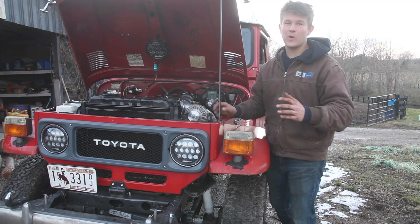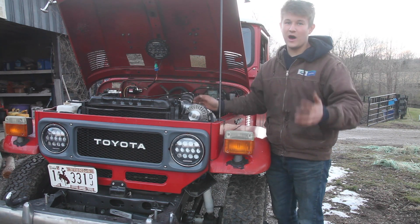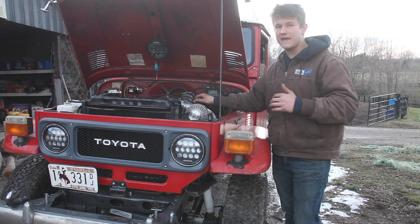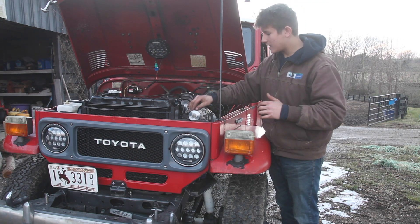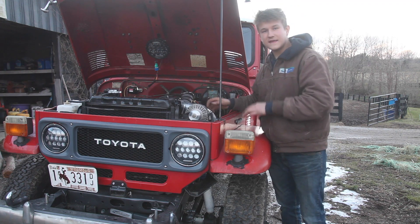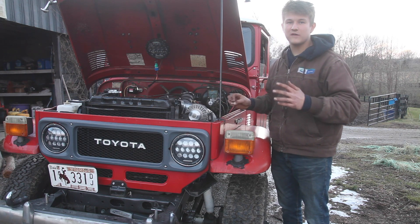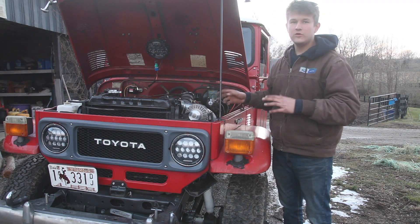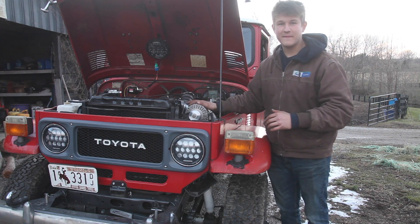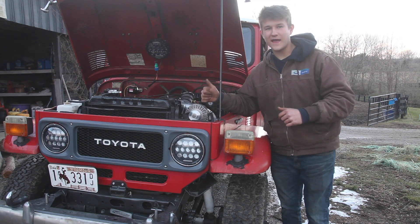Thank you guys so much for watching — I really hope you enjoyed this video. This project was so much fun and I'm so stoked it worked out. The Land Cruiser runs awesome with this supercharger. There were a few tweaks I did that I didn't film: I added a fuel pressure gauge as a boost gauge and we peaked out at 5 psi at max RPM. I also did a lot of filing to the pulley on the supercharger, bringing it from 4 inches down to 2.5 inches to get that 5 psi I wanted. The last thing we need to fix is replacing the mechanical fuel pump with an electric one, because around 55 mph at high RPM it'll start to bog and die due to a shortage of fuel. All in all, I can definitely feel the power — the supercharger added around 50 horsepower. The Land Cruiser goes the same top speed, but it gets there a lot quicker than it used to.